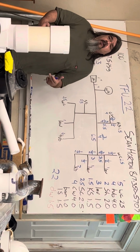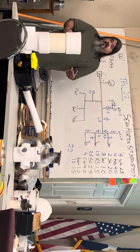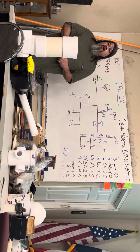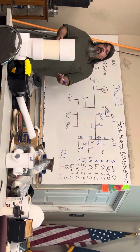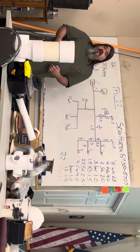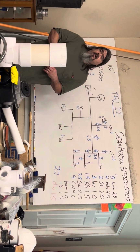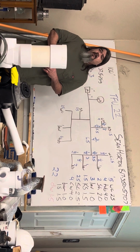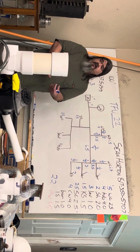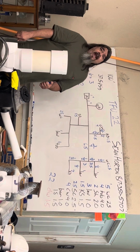So if you don't have a meter, you can get like a 1-inch jumper and put a reducer on it with a gauge on it, crack it open just long enough to get some pressure and check the pressure at the meter. Because that's basically just a 1-inch thread for a 3/4 meter. A 1-inch meter is gonna be 1.25 inch threads. It's gonna be the next size higher, maybe 1.5 inches. I don't know. But you'll be able to jerry rig something together and make up a little gauge rig to hook up to the curb stop and just tighten that nut onto the nipple and then turn it on long enough to get your pressure. You can get that.